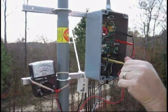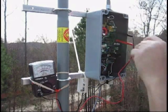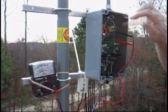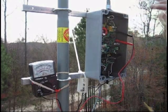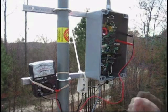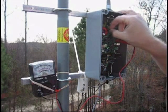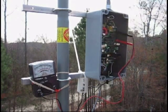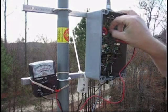Just set the power so you've got a good reading — it doesn't matter really where, just so you've got a good reading. Start out with a jumper shunt approximately in the middle. Keep your fingers away from the antenna and the coil — when I touch the coil and the antenna, it just totally gets messed up. You want to do the tuning after the transmitter is totally installed and the wire is all secure in its final position. It won't work if you try to tune it on the ground. Just take the jumper shunt and try a couple different positions. If you have to, take a piece of paper and record the voltage at all the different jumper positions, then pick the point at which the voltage is the highest.